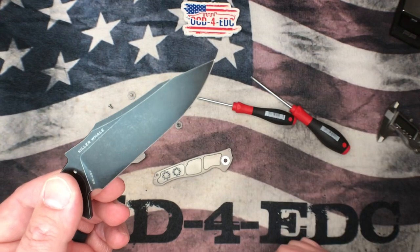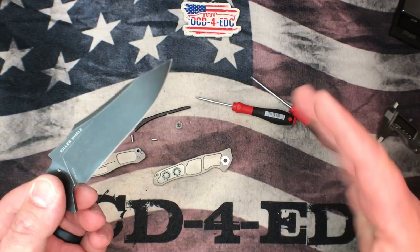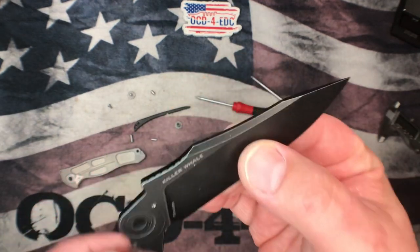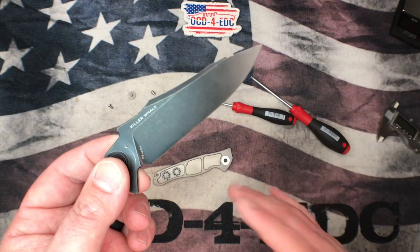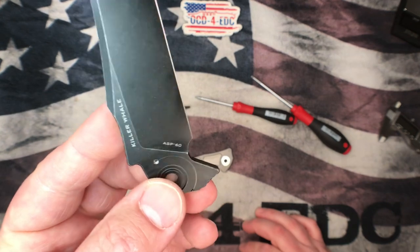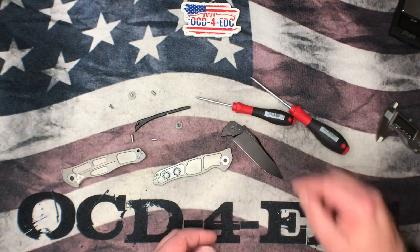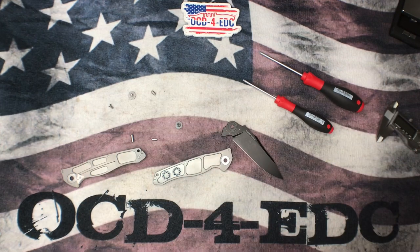It's not going to be the toughest thing in the world. On the other side, Rex 121, which is kind of the pinnacle, is going to be like 26–27% total carbide. So this thing at 21–22% total carbide is a beast. Rockwell hardness should be somewhere between 68 to 72 HRC. Hopefully this one is extremely hard because I'm definitely going to do some testing on this. These high-performing steels are one of the things I really enjoy about the knife community — dealing with all the different steels, seeing how they perform. I love the performance of it.